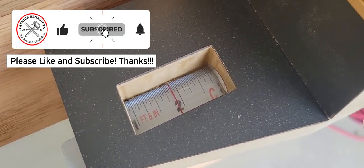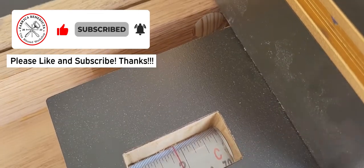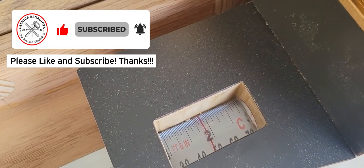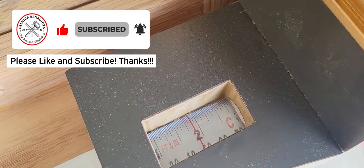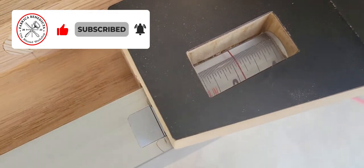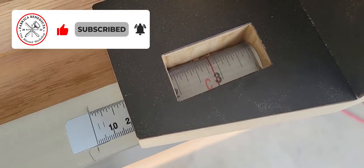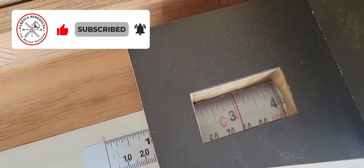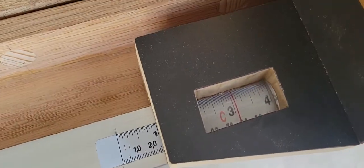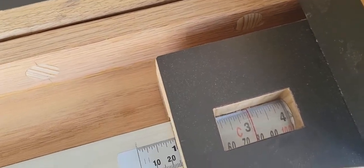One of the features that I put in here was a magnifying cursor. I took basically a magnifying piece — like a magnifying lens for reading books — and I cut it down to two inches to fit down inside here so that you can get a magnification on the edge. I can slide it down and you can see it move. It magnifies quite a bit, which is really nice especially when you're getting older. You can see all the measurements in there and it locks down nice and straight.